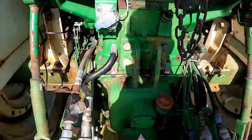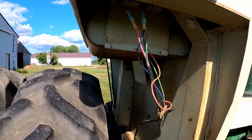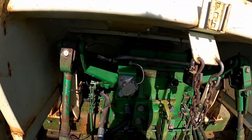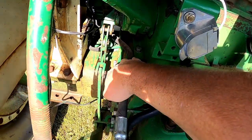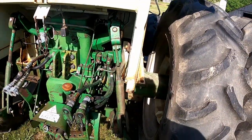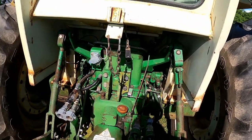They probably had problems with rubber hoses getting kinked or collapsing. So later on — this is the 1955, which has tanks built into the cab under each fender, not nearly as big as the fender tanks on an open station; I think they're around 20 gallons each — the same routing would be used but they ran a steel line. It comes around and there's a T that feeds the right tank, then the steel line goes up to the front. In the case of this diesel it goes in with the return and suction pulls these tanks down. The steel lines eliminated kinking and pinching that rubber hoses had.